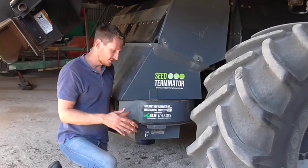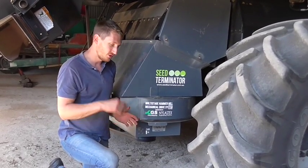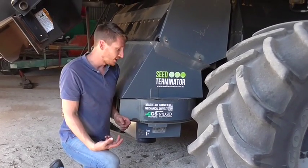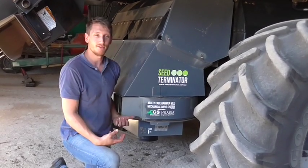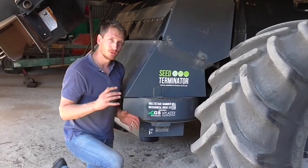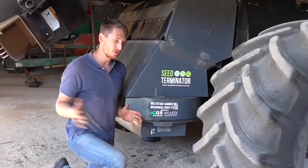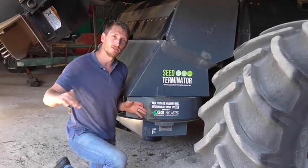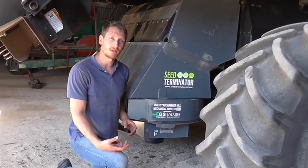The hammer mill has flail centres which enables good pulverisation, but it also makes it a bit more bullet-proof if something hard goes in there. The multi-stage hammer mill has multiple stages of impact and screening. We're belting it against a screen which has large openings at the centre, and then those openings progressively get smaller. That's really how the multi-stage hammer mill gets its high capacity.